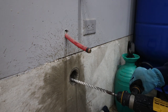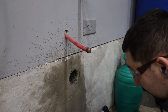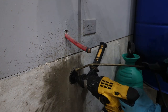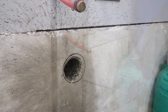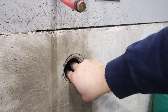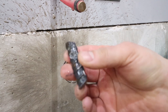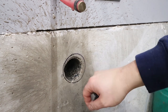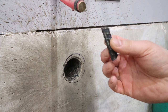I think I hit a piece of rebar — we're drilling right through a piece of rebar. We are about halfway through it. I think we made it through the rebar. Oh, it's loose — okay! So here's that piece of rebar we drilled through. It was laterally right there, way back in that hole. We're in about three and a half inches, with another two and a half to three inches to go, but with this piece of rebar out of the way, this hole should go much faster.